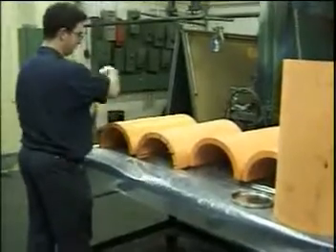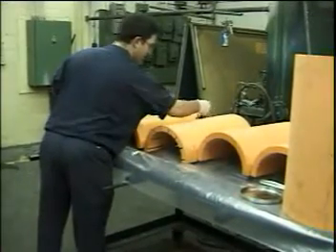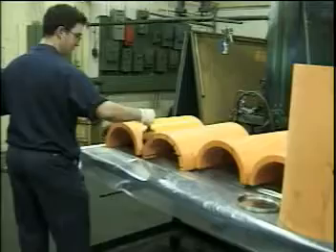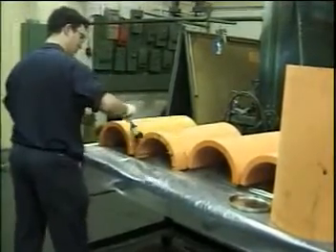Both the bronze metal carriers and the bearings are cleaned with a solvent prior to the application of the adhesive. Typical solvents are MEK or isopropyl alcohol, or any degreaser that will flash off very readily and not leave a residue.